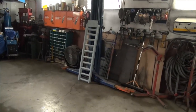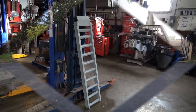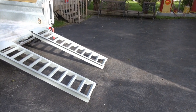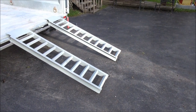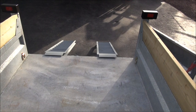There's the ramps. Here's the ramps — they're pretty strong. They're made out of three-inch channel, a quarter inch thick, and the angle iron is a one-and-a-half inch angle iron, so they're quite strong. Hopefully nothing will fall down through it — like myself.